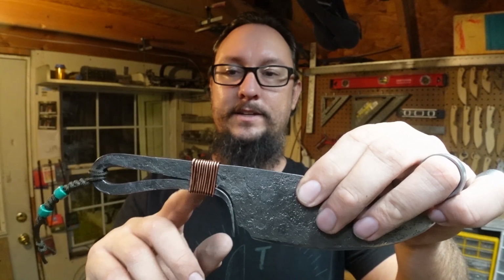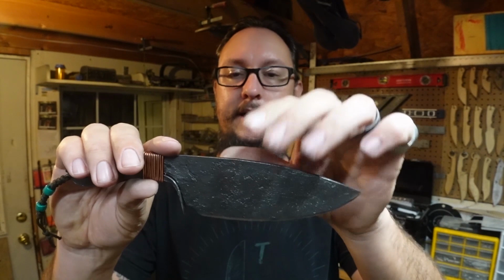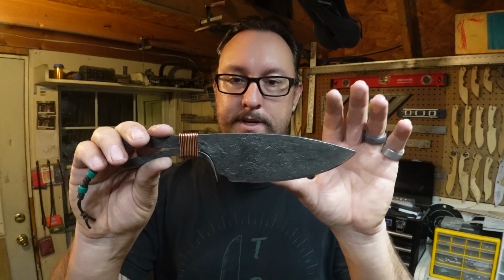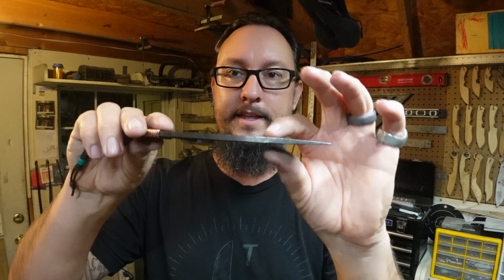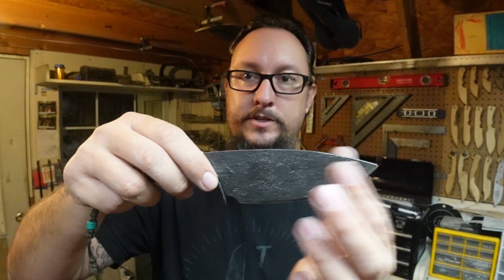During the forging process, I focused on initially singling out the area for the tang, and then going ahead and focusing on the blade, then coming back to the tang, and then smoothing everything out, and then finalizing the tang. The whole point behind what I was going to do here is I knew that I needed X amount of steel to be able to forge in that tang, so that's why I isolated it first. And then I went into the blade profile, just kind of set the preform, and then got some bevels done, and got the bevels and then the spine, and then got the distal taper put in there, just refined enough so that I could hold it and then focus on getting the tang drawn out, and then switch back, holding the blade or holding the tang here, and starting to finalize that blade.